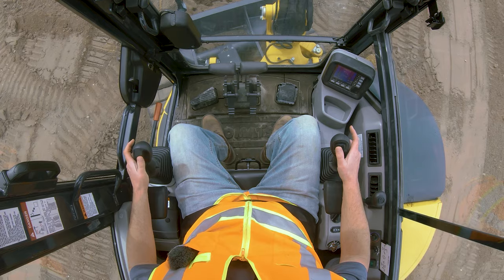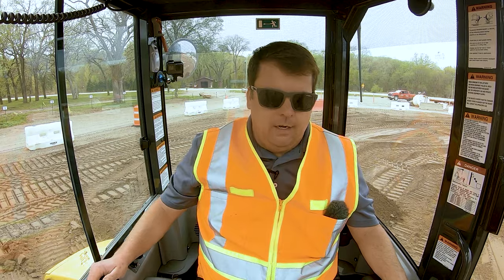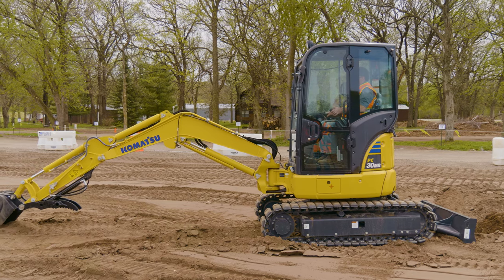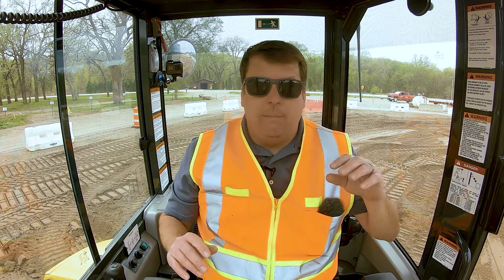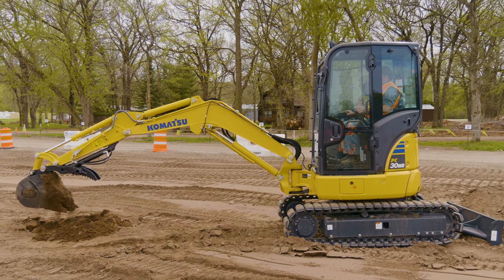The other way I like to dig is with the blade in the back. If you have the blade behind you and push downward pressure, there is no way you can lift this machine up — it's much more stable when it's in the back like that. So I generally will dig with the blade behind. There's no right or wrong answer, but it changes that pivot point and fulcrum when you're pushing down; that's where your counterweight is.